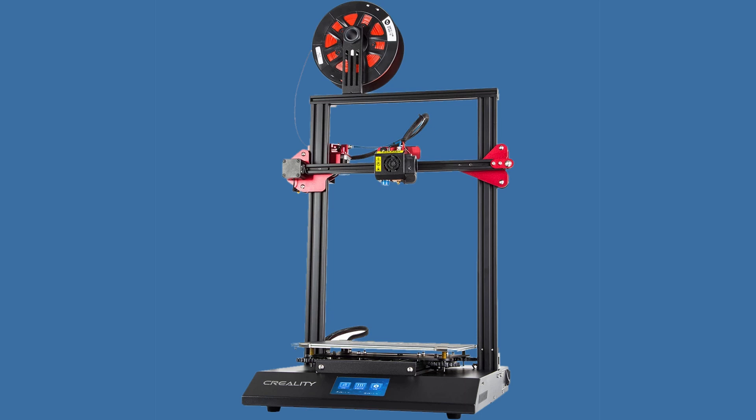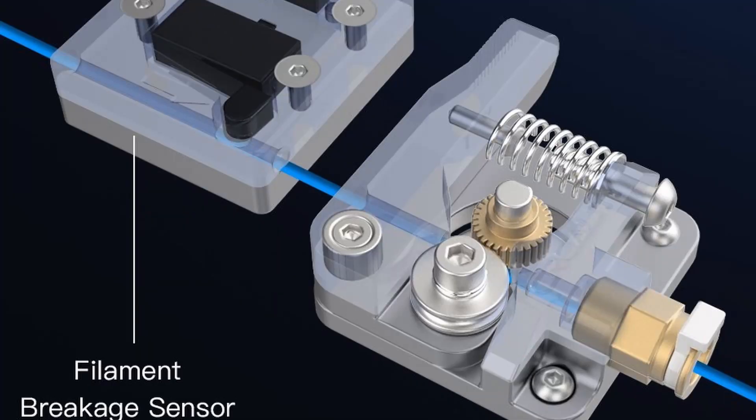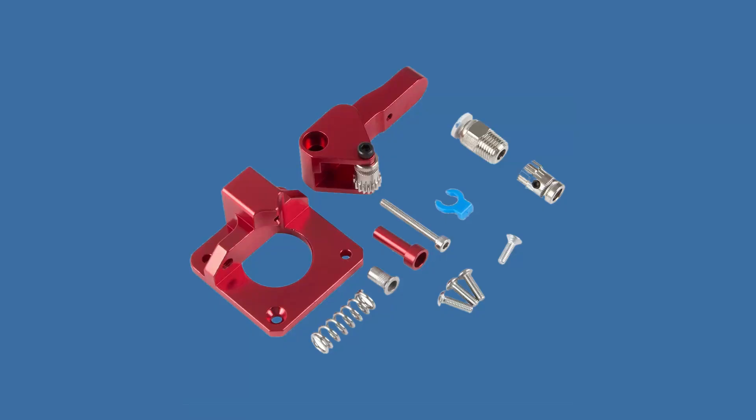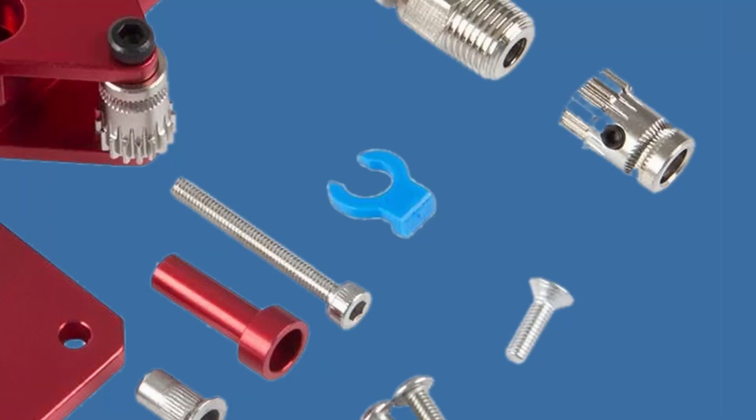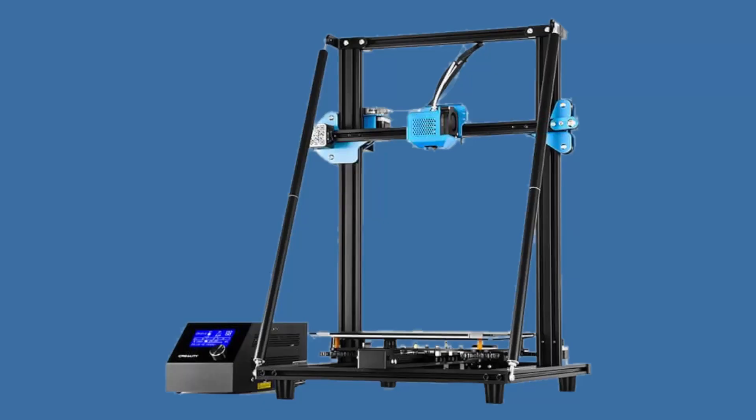The second issue I don't like is that we get two extruders and none of them is dual-gear. The CR10s Pro comes with a dual-gear extruder and both gears are chamfered, which grip the filament much better than anything else. In addition to both extruders being single-gear, each of those gripping gears has straight walls, so they grind the filament more. So that's actually a third problem for me. If I were to receive this printer as a gift, the first upgrade would be to a dual-gear extruder.